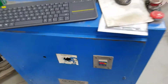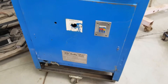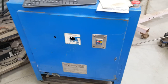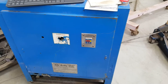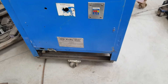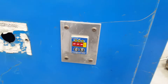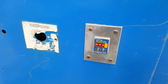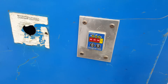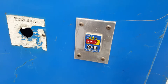Here's the computer. I found this housing at the scrap dealer as well — it used to be a lead-acid battery charger. It was already gutted out, just the housing, so we mounted it on some wheels so we can roll it around. Here's the automatic torch height controller. It senses the voltage, and if your metal warps or isn't sitting flat it'll automatically adjust the torch height depending on the voltage.